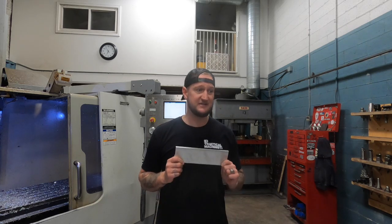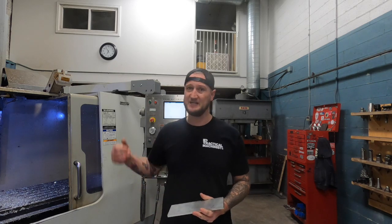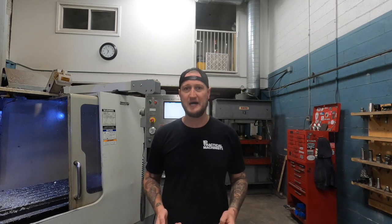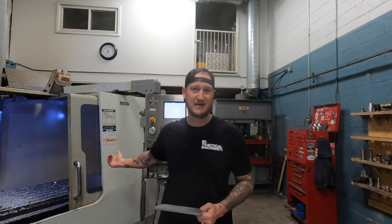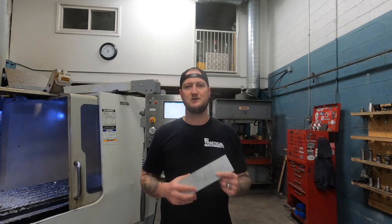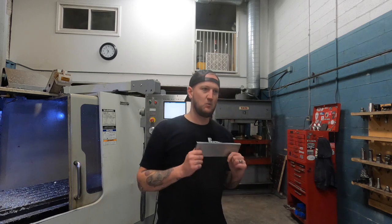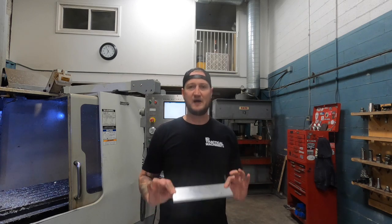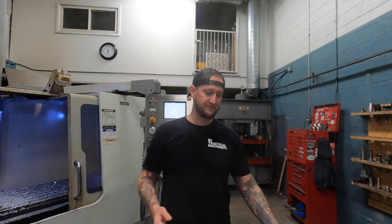I end up using a lot of aluminum for a lot of stuff because it machines super easily, I can get it easily, and it's not gonna beat up my cutters. If you have a really good high helix three-flute end mill, that thing will stay sharp in aluminum for a very long time. It's about not only tool life and longevity, but my cycle times are gonna be half of what they are in steel without having to invest in expensive tooling. One consideration: never substitute a cheaper or worse material because you are cheap or lazy. This is about finding the intersection between expense, machining time, and what your customer actually needs.